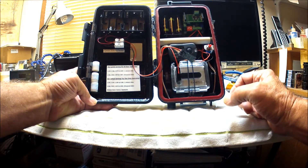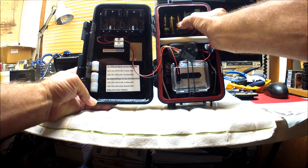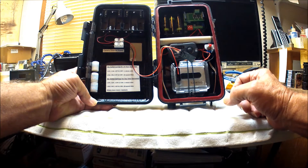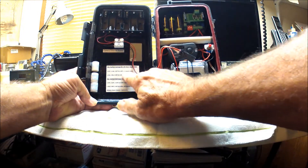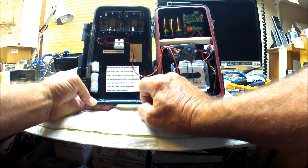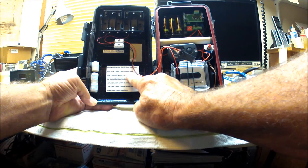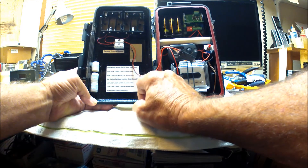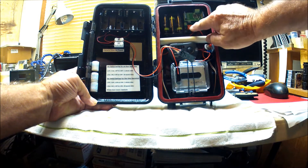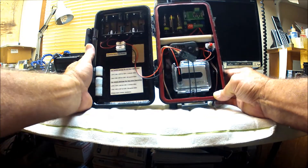You can use three or all six external batteries, and it's recommended to use rechargeable double-A batteries for the camera's external power. You can also use rechargeable double-A's to power the control board, or alkaline batteries. There's a dip switch setting so you can configure the control board for 24-hour operation shooting video night and day, one-minute video length, 30-second video length, or daytime-only video — just change the dip switches to match what the label says.